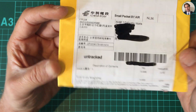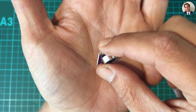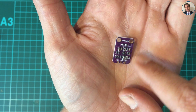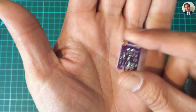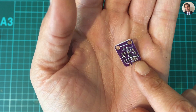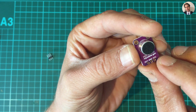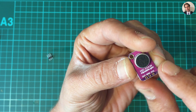Next one says a module — one of them. So this is a microphone, a little electret microphone. It's based on the MAX4466 op-amp and it has some adjustable gain. It just makes it easier to do some experimenting to see if this is a good op-amp to use for small microphone projects. It has quite a wide input range — 2.4 to 5.5 volts. So if you use a 3.3 volt microcontroller, you can still use this microphone.